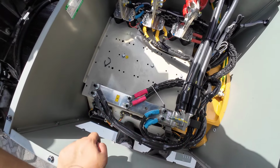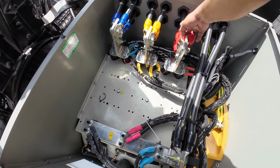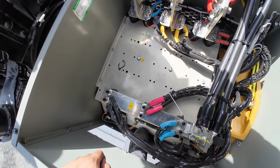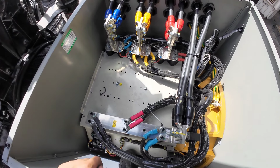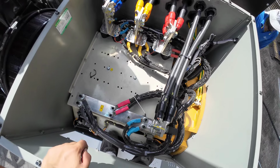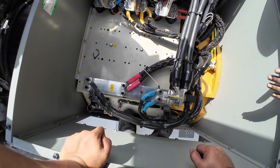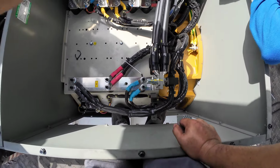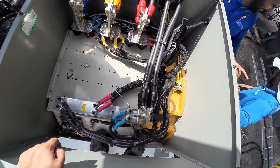Yellow, how about this one? Is blue? The last one. No, that one is earth. This one. Yeah, this one. Blue. We found out that the connections here are red, yellow, blue, but at the end is wrong color coding. So it is wrong. Here it's correct in this color, but the end color there to the breaker is wrong. So we were going to call the people.